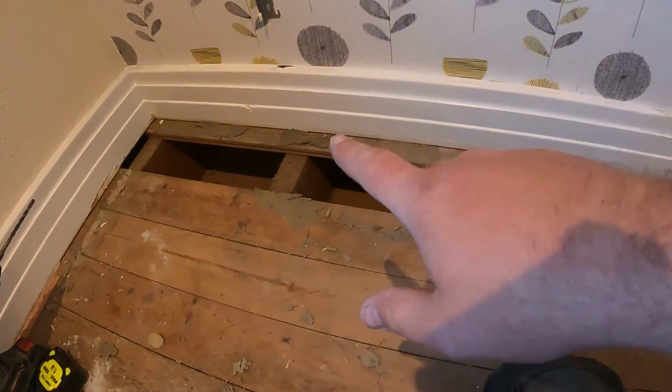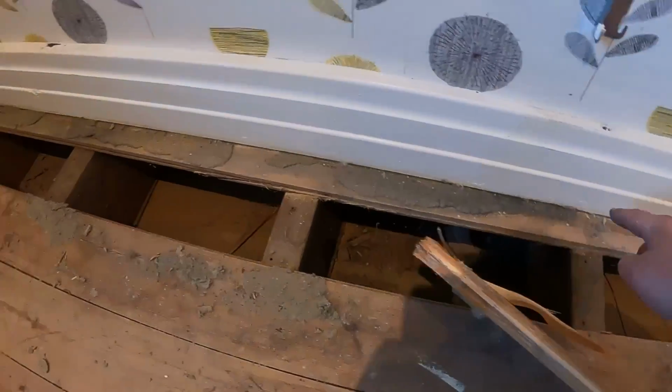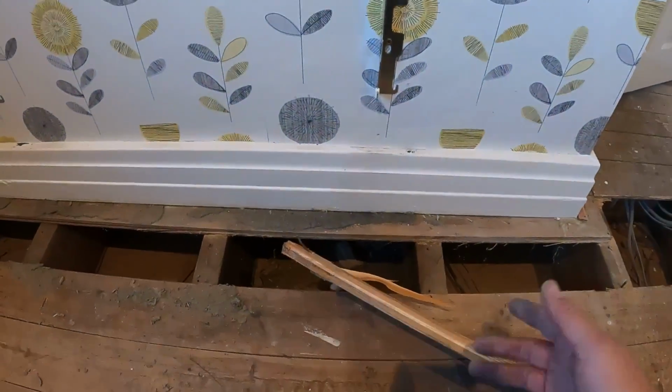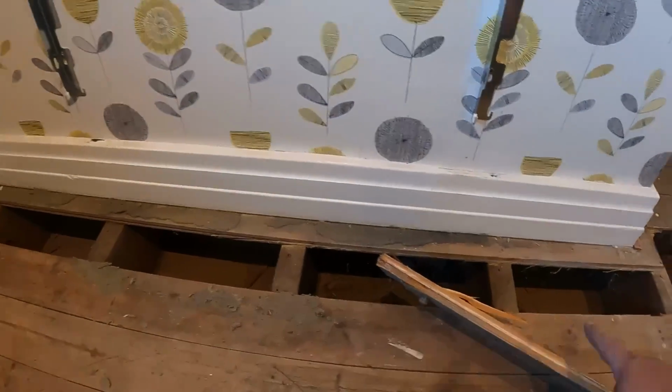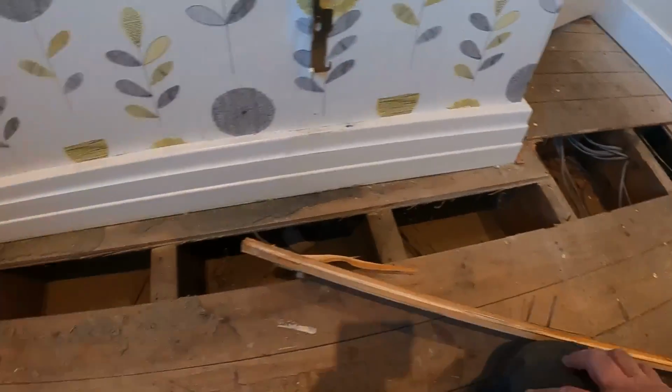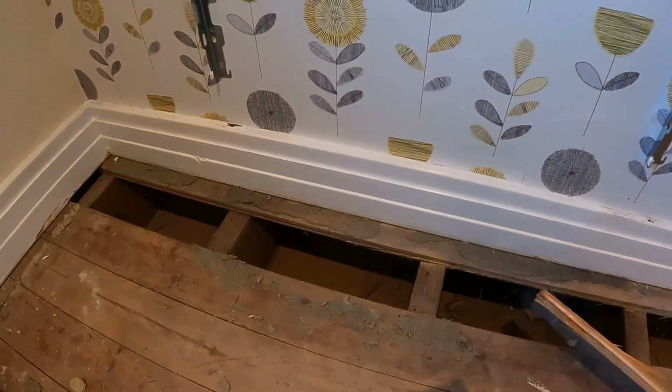Then what I'm going to do is offer the board back in, and now we know there's nothing underneath, drill them 2 holes out, and then we can whip the board back up again, get it notched, get some pipe work in, and get the tails up.